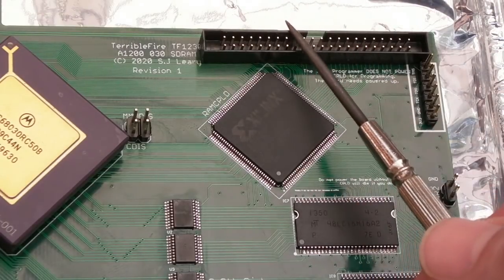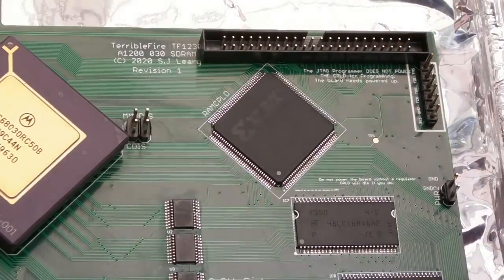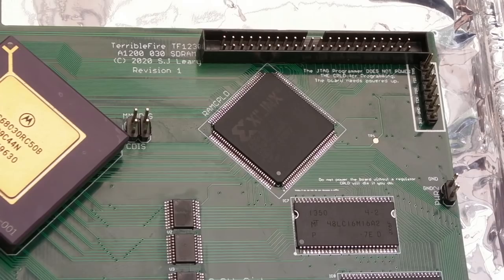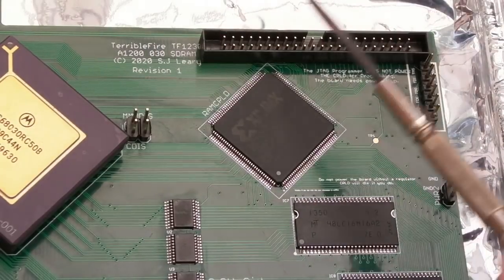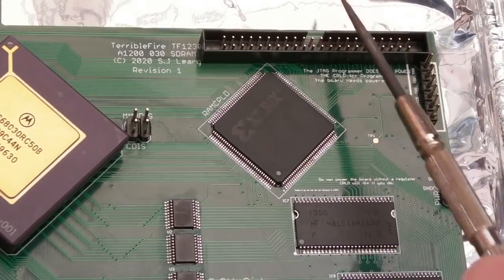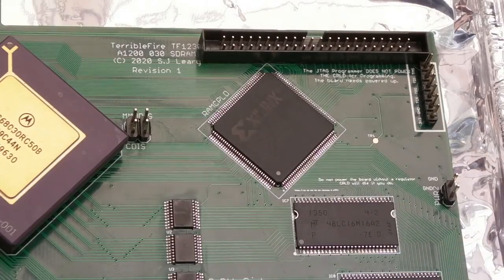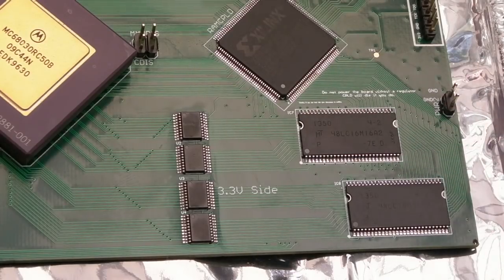It might already be running PIO 4, it's just basically the 030 that's the limit here. It's using PIO 0, isn't it? But 3 meg was not too bad for me on my 1200. But I do know that with the 536 you get 3.6 meg, and that hasn't got an EHIDE, so I'd suggest that maybe this is capped at the moment as Stephen's just testing things out with the Release Candidate firmware. And of course, it's nice that this supports 128 meg or 64 meg, so you've got some flexibility there.